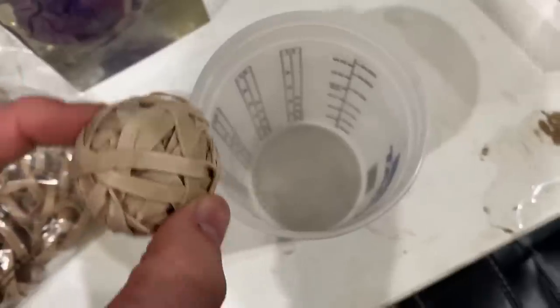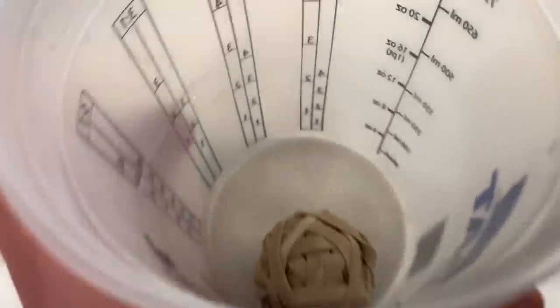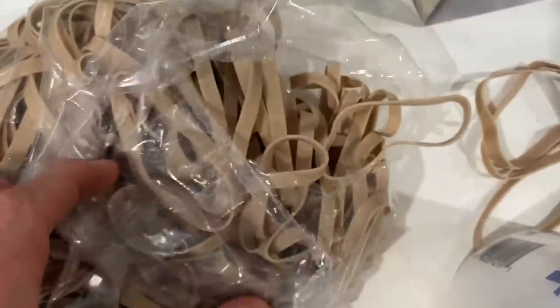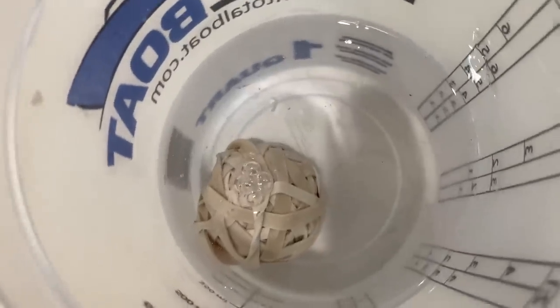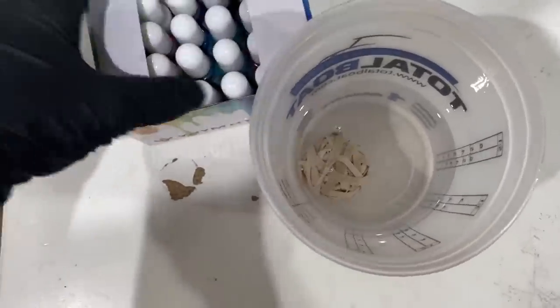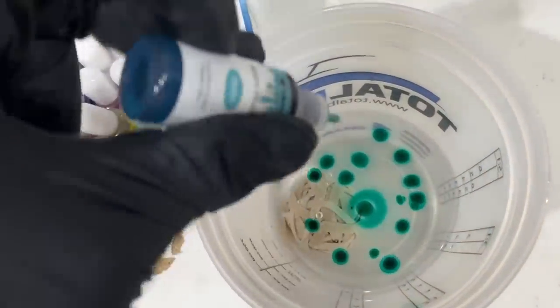What I decided to do is fill a cup up with enough resin to submerge the small core in, and that will seal it all into the core. Then I'm going to individually dip each rubber band in the resin so that every rubber band will be drenched - there's no way the vacuum won't be able to pull all the air out. I'm actually going to add some dye to this. As they say, a little goes a long way.